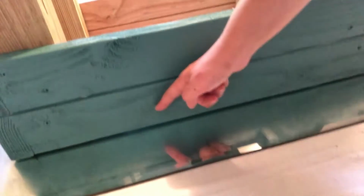I'm also gonna now take some clay and go around the edge of everything here. So we're gonna go all the way around the edge and put a layer of clay so that just in case the weight is not enough of the table, that we make sure that none of the plaster leaks out all over the floor when I start to pour the plaster.